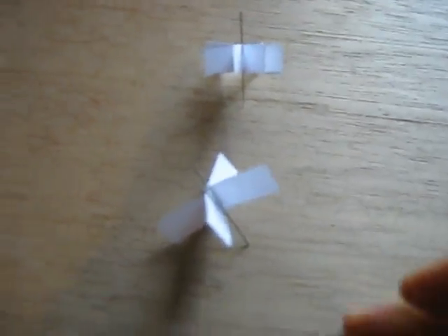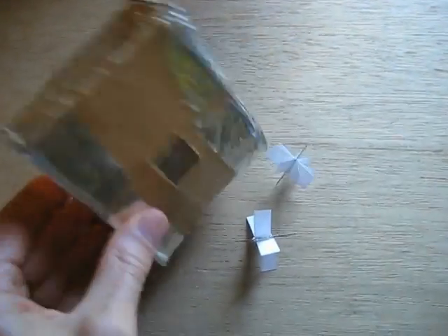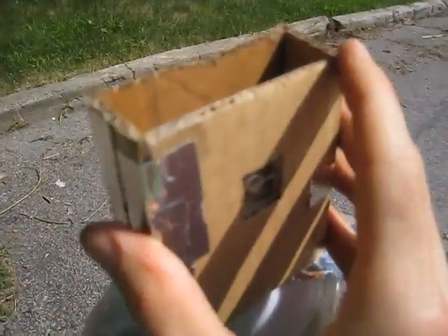For the second day of testing I made these small, very lightweight turbines out of paper and sewing needles. I also made this cardboard enclosure to minimize wind effects. Each time I move one side of a turbine over the outlet from the funnel I get a little rotation, but as you can see there isn't a lot of torque being produced here, and the physics calculations indicate there wouldn't be either. The torque I am getting didn't start happening until the entire pipe got very hot, which makes sense — with a hotter pipe the air loses less heat to the pipe as it rises. It's the insulation which allows the pipe to get that hot.